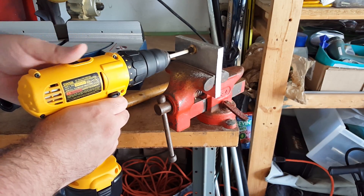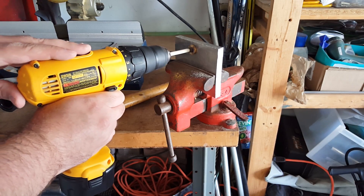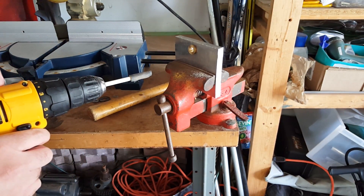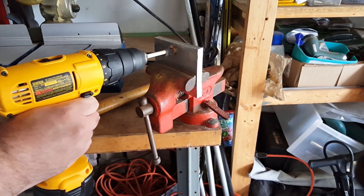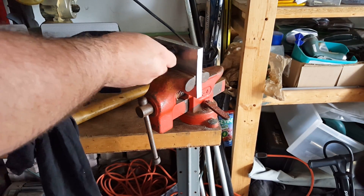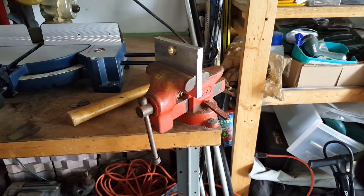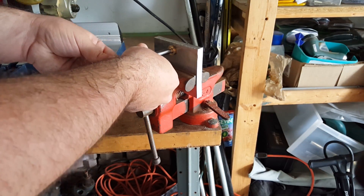Make sure to keep the drill as straight as you can, and the natural motion of the lapping tool should keep it pretty concentric, considering you're only taking off a thou or half a thou. I started lapping with 400 grit sandpaper and then went up to 800, 1200, and then 2000 grit. The higher the grit sandpaper, the better the finish you're going to get. Ideally you'd be done after machining, but if your bushing got compressed slightly more than expected, you'll have to take that extra half thou out using a honing or lapping tool.